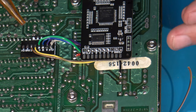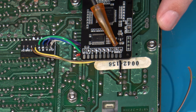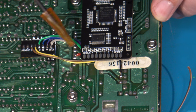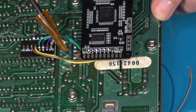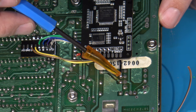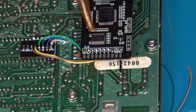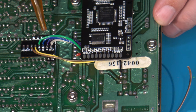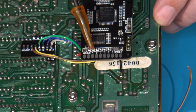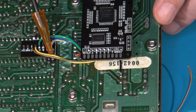I now have the bulk of all the wiring done. Let me quickly summarize what's been connected. On the input side, I have my 5-volt and ground coming off different points on the main board — the 5 volts pulled from the two leads coming through from the power supply going to the 5-volt rail, and the ground attached right here. After that, you have the clock signal and then the A, B, C, D, E connections. The clock signal is attached off the pad marked clock on the QSB off the stick. Then A to A, B to B, C to C, D to D, and E to E.